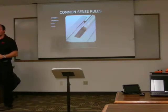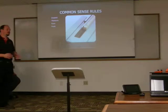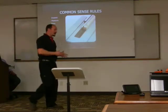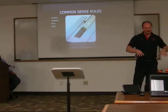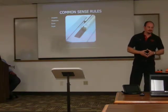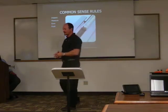The next most common problem with the table saw: you only push through a saw blade. I worked with a gentleman who had to have more than a dozen surgeries to put his fingers back on after he pulled a piece of masonite back through a saw. Eighth-inch masonite you can break with your fingers, but it will take your fingers off when it comes out of that blade.